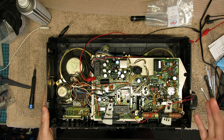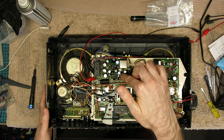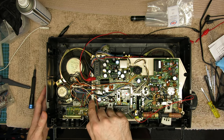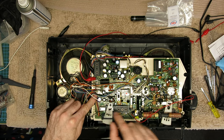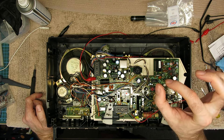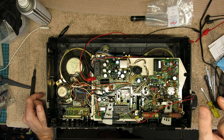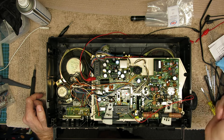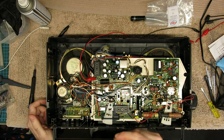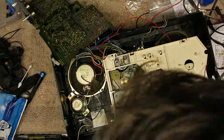If you've got one of these, in these positions keep an eye on those capacitors — if they're the purple-jacket Panasonics, the big ones, get them out of there. Have a look around for any corrosion. If you get any corrosion around these printed resistors, the track on those — not the carbon resistor itself but the track either side — it might be solder or something, but if it gets the slightest bit corroded or even if you try to scrape it clean, it's just gone. Even all the switches were pretty clean on this. After stripping and washing it's come out much cleaner — even the chassis.